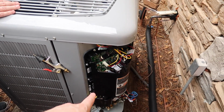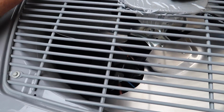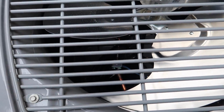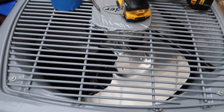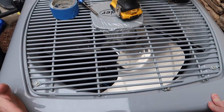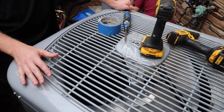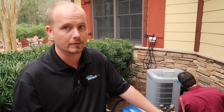So is this the compressor on the side here? No, the compressor is actually inside. Oh, it's inside here. That's the heart. Yeah, so the thing underneath that blanket is the compressor, and that's what actually compresses the refrigerant. That's most of the amperage, most of the current being drawn on any air conditioner is drawn by the compressor. So this compressor technology is very unique in units of this size. This is a 4-ton system using a variable rotary compressor.